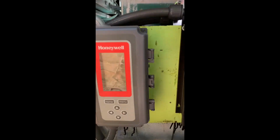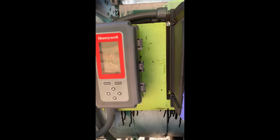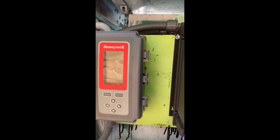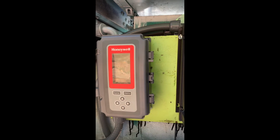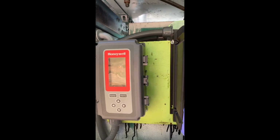The generator coolant temperature gets up to about 192 degrees. I have the set point set to start to seriously ramp the fan speed. The generator on a 90-degree day with a light load on the electrical side, maybe 800 watts, so really light load running, was commanding the fan to run at about 30 hertz, which is still below the fan being really noisy.